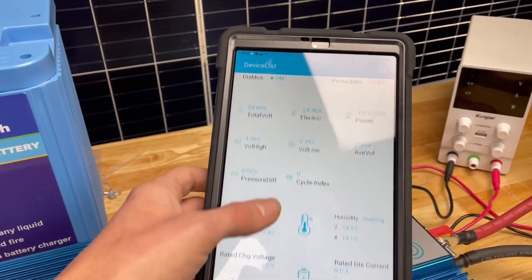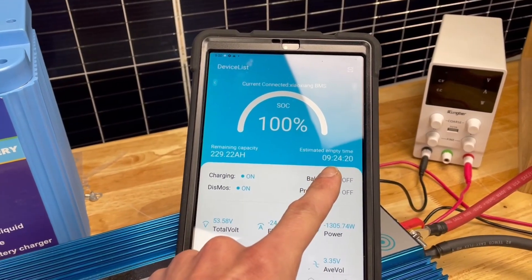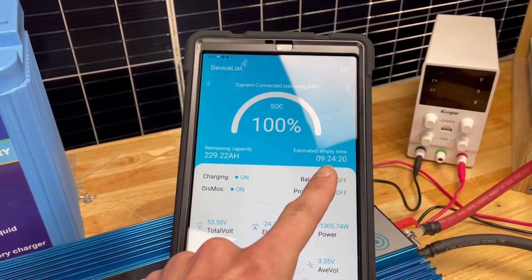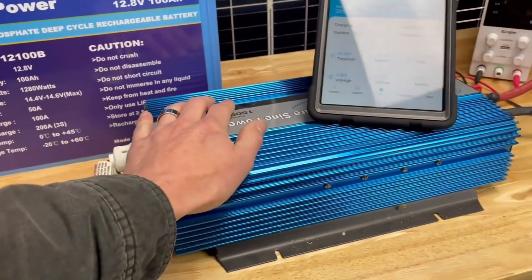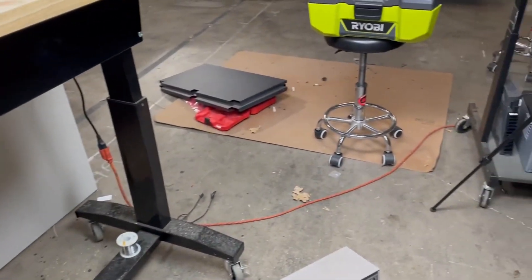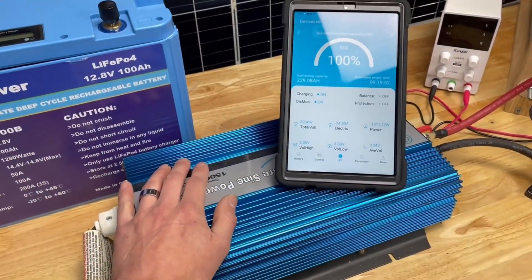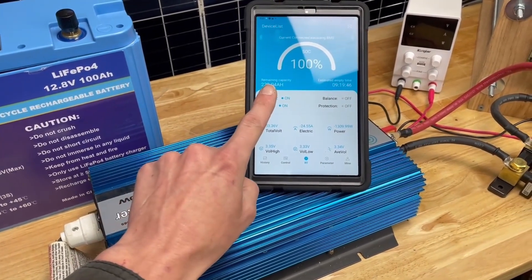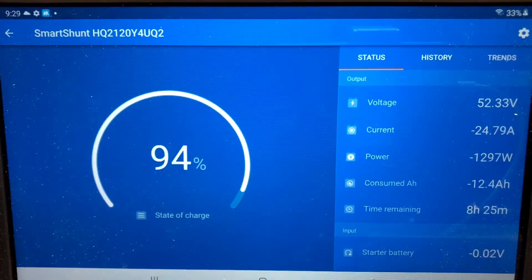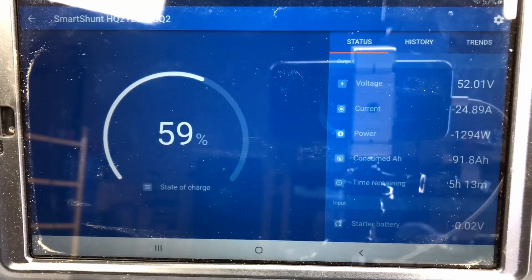The cells will drift once this gets down to the 2.8 volt range — that's when you'll see more of a difference — because these are top-balanced cells and every cell inherently has a slightly different capacity. The app gives us an estimated empty time of 9 hours and 24 minutes. An ideal discharge rate would be 5 hours, but with a 1500 watt inverter pulling about 1200 watts we'll do this 9-hour discharge and hope to get a little more than 230 amp-hours. If you want to buy lithium iron phosphate cells straight from China, I'll throw a link in the description.